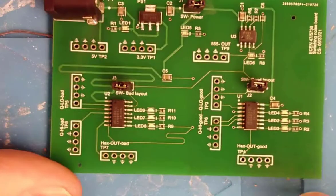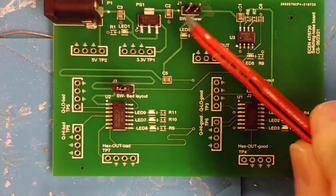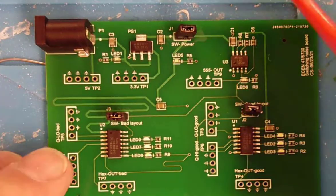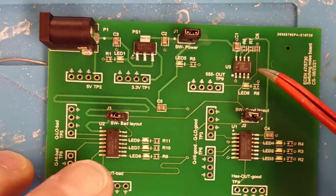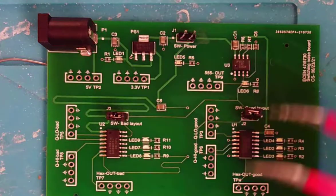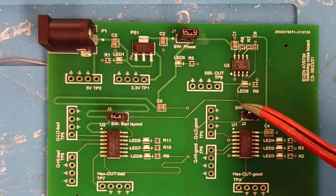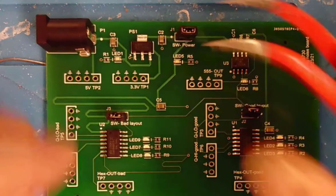Here is the assembled board with the little flag in place to do the short. With the flag taken out we isolate the connection between those two pins, and when we add the little shorting flag we make a connection between those switches — it's like turning it on. We use that switch in three places: first, connecting the 5 volts to the 555 timer; second, isolating the output of the 555 to each of the two hex inverters; and third, doing the same on the other side.